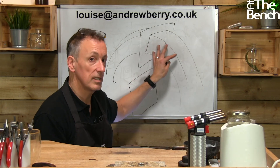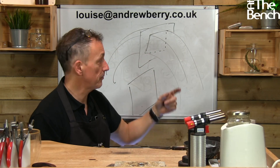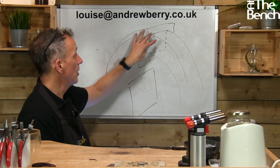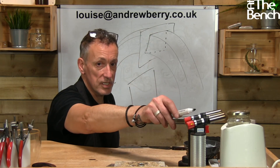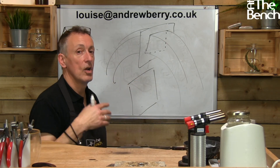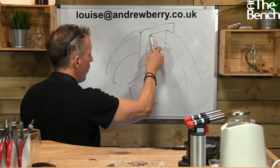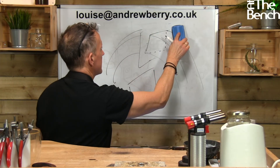No flux — if someone says you need flux, you do not need flux with platinum. You get your special welding glasses; you need those because the bright white light given off with platinum will damage your eyes over time. You cannot use these little butane torches as they don't give you enough heat. You have to use an oxy-propane or oxy-acetylene torch, like a Smith Little Torch. You put the flame on it and it melts the sliver, which melts on top of the join and welds it.